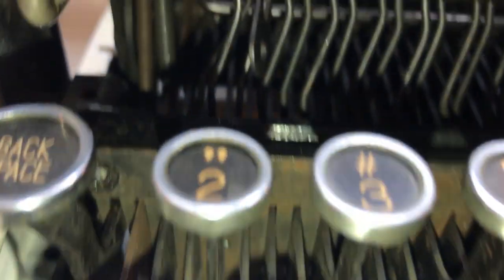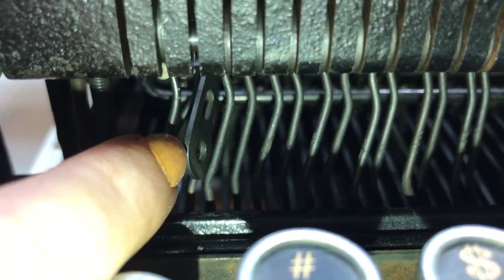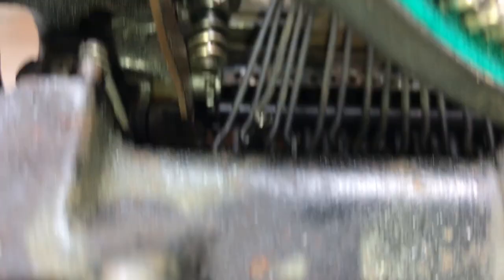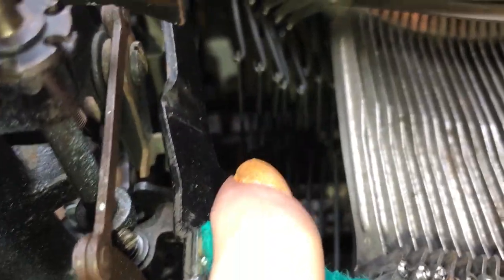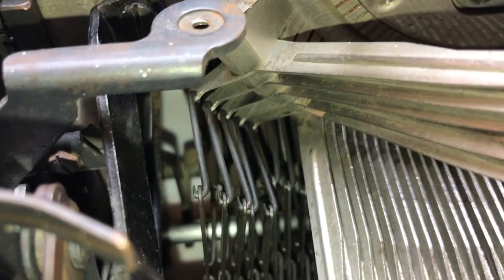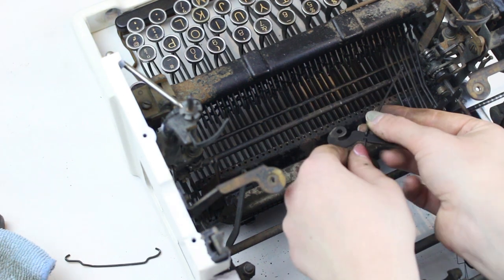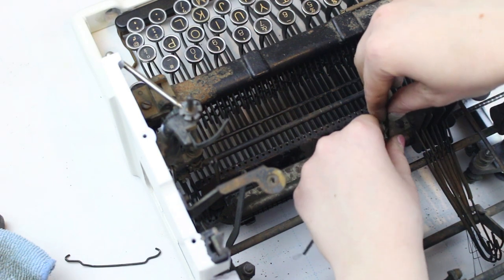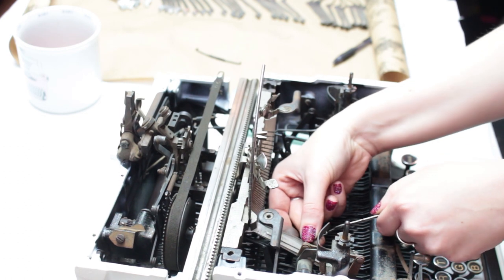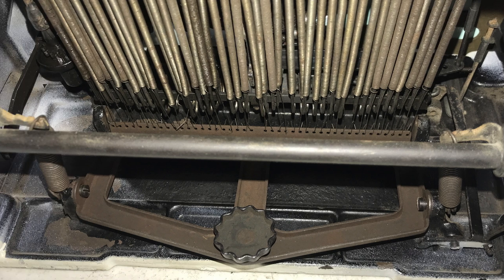So this key lever attaches to these little hooks, which are numbered, and these hooks attach to these curved pieces held in here. These curved pieces hold a longer piece of linkage that takes you to these standing-up pieces of linkage down here. These link to the back of the type bar, and they also link to the back of the typewriter where those springs are. I then linked all of these pivot point pieces, which are also held in place by a bar, and linked each of these to the curved pieces from that front panel area. Each of these pivot points is linked to a type bar or slug held into the basket with an S-shaped wire linkage piece. The back of these pivot points are all attached to the tension mechanism at the back of the typewriter, with a series of shepherd hook-shaped pieces and springs.